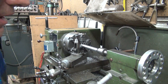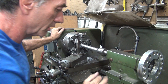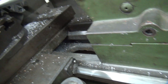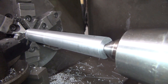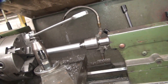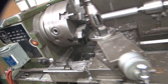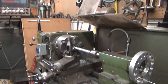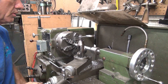I think it's close enough. That's six inches — we're a quarter thou off. That's pretty close. I ended up moving this quite a bit. This doesn't consistently miss. I got a pretty good step on here now. But when you back it off, you can see how it comes in nice and even right there, nice all the way around. So still got that same quarter thou in there. I can try to get it some more by tightening this side over here a little bit more, but it's pretty close. We're probably getting a quarter thou in six inches — not that bad of a deal, it's actually pretty damn close.